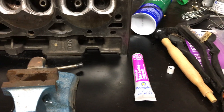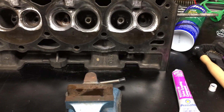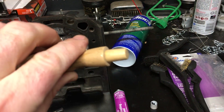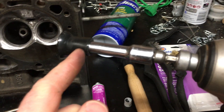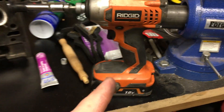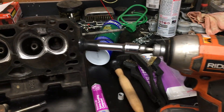I started out doing most of these by hand, and it's kind of slow going. I did some checking, and the little plunger here will actually just slide right off the knob. A little 3/8 extension fits in here pretty snug, and then I connected that to my little drill here. I've got an adapter to grab onto the 3/8 extension there.